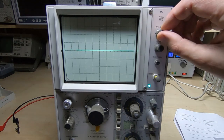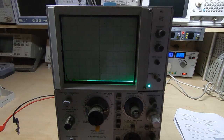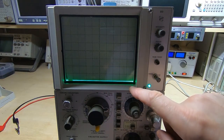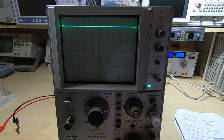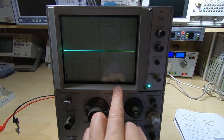I'll set up the machine so that we're getting a suitable display. The next adjustment is geometry. I'll move the light out of the way so you can see the trace more clearly. There might be some flicker on the display for the camera, though there's none visible in real life. What we're looking at here is making sure that the trace is flat and level relative to the graticule. At the bottom of the trace that's fine, at the top that's fine, and in the center it's also fine. If it wasn't, there's an adjuster on the back we could use to adjust the geometry, but we don't need to touch that.